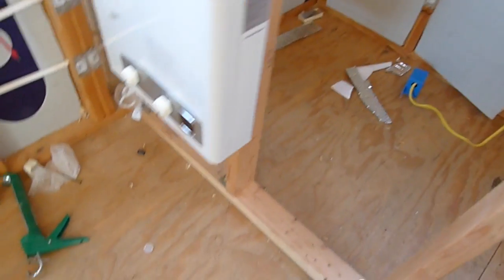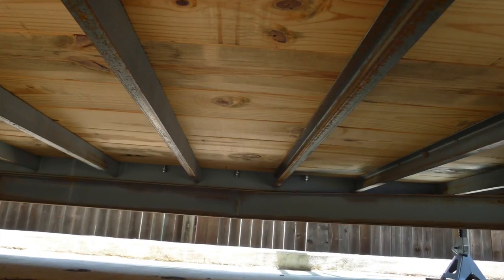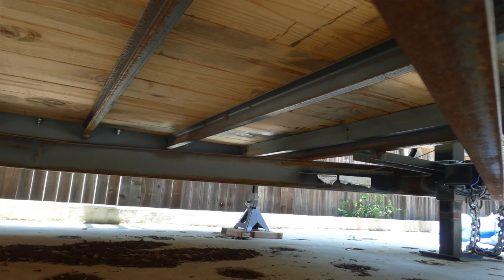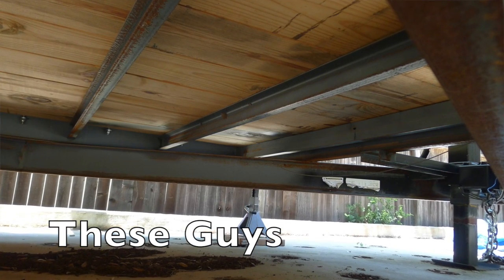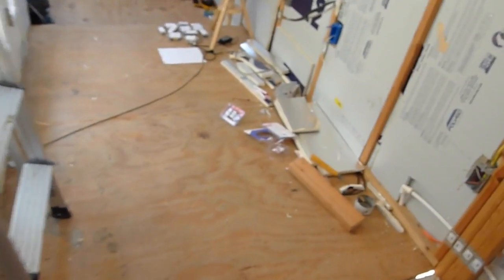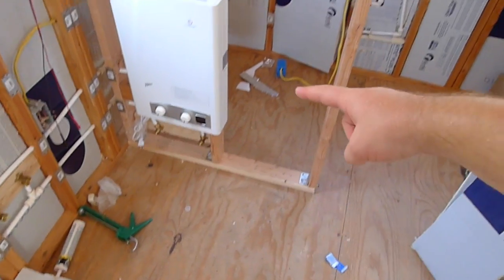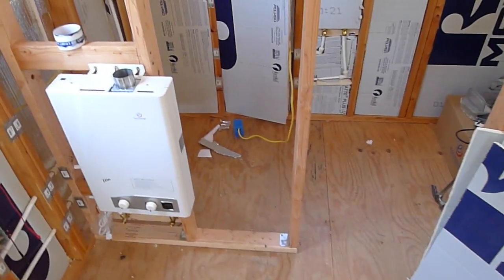I'm thinking about the propane line. My plan was to come up through that bottom plate right there, and then have a little outlet just like the water outlets down there. But then I took a look underneath this house — I'll pop a photo up on the screen. What I noticed is that the large beams holding all the cross members of the bottom of this trailer go down lower than those cross members. So I don't have to drill holes through all the cross members to get to the front of the trailer to put the propane connection out on the tongue. What I think I'm actually going to do is get some hangers — little metal straps with a lock nut — and have the propane line go straight down through the floor right there and back on hangers all the way to the front, then routed out to the propane tank up there.